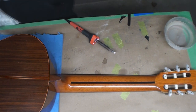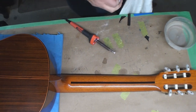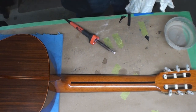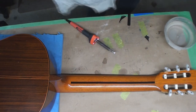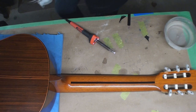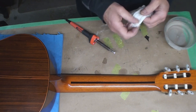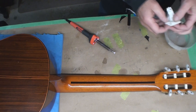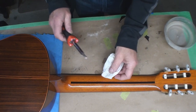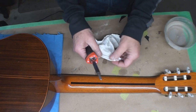For this procedure I need a clean cloth - I don't need this much clean cloth - and I got this big ugly old soldering pencil. What we're going to do is create some steam and try and pop that back up. Always remember: make sure the rag is really good and wet. I probably have a little too much rag there.